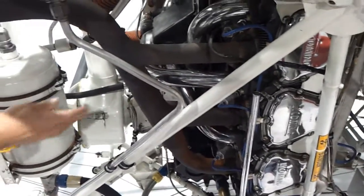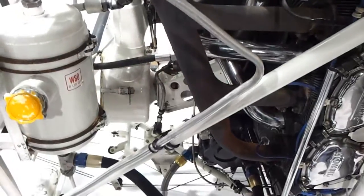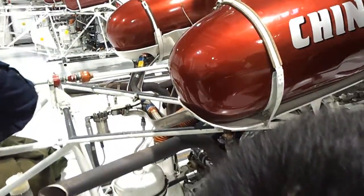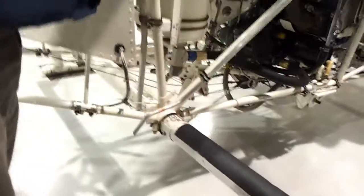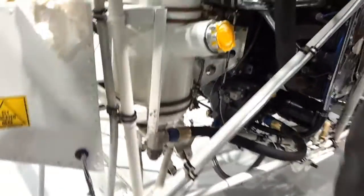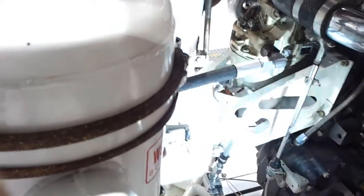Working our way back — exhaust. We've got the exhaust manifold and the intake manifold. The air comes in through this hose right here — there's a little scoop at the front. The air comes in, comes down through the hose, into there — that's where the air filter is. We're not going to open it; it's not serviceable by us. Every 50 hours, the engineers open it up, take the filter out, and clean it.